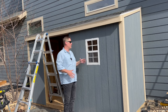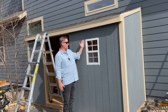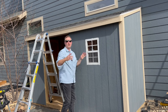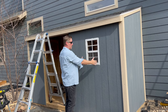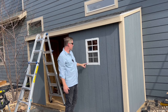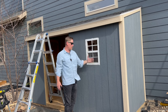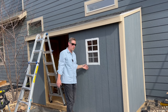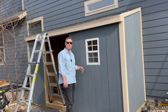I've got the window put in now, as you can see. This was a super simple window to install and it's a great price — it's got tempered glass. It is 14 inches wide by 21 inches long and fits perfectly in between the studs. Earlier in the video I mentioned I offset my studs a little bit wider on each side — it's because I wanted a 16 inch opening to fit this window in. Cut it out, and it's already got the screw holes laid out. Screw it right to your studs. I've got bracing here and here, and this bottom one I flipped on its side because we're going to put a little planter box underneath the window. Once I get the trim on, we'll build that planter box later on.